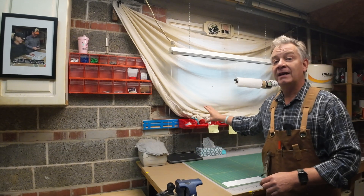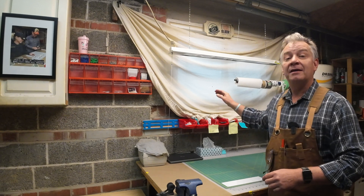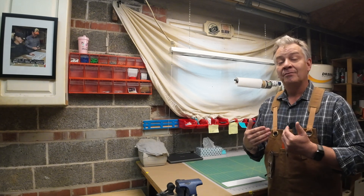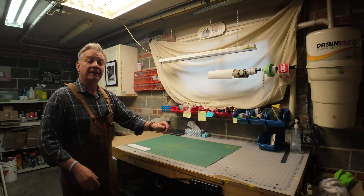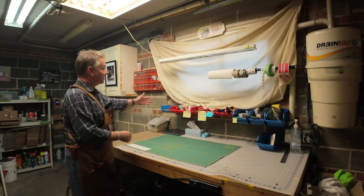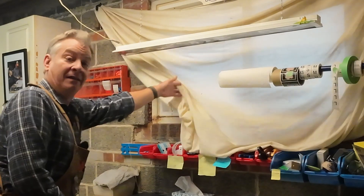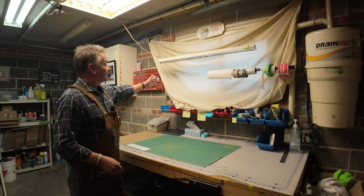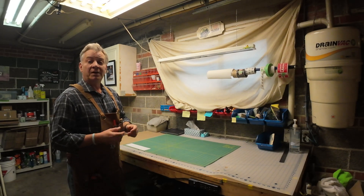You may have seen on some YouTube channels creators who add a second exhaust fan in series in the pipe to try to push fumes the rest of the way because they're getting smoke in the room — meaning the existing setup isn't strong enough. What I've done is moved my workbench down as far as I can so I could place the laser within a couple of feet of the window. It's a basic everyday vertical slider, so I purchased a window duct kit.